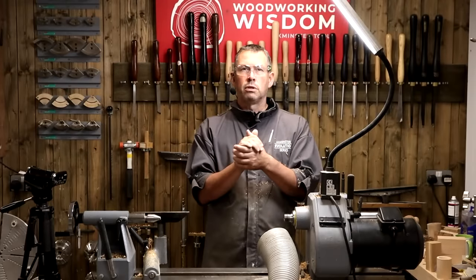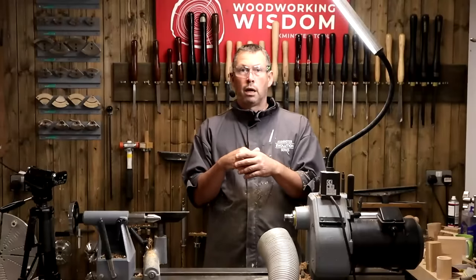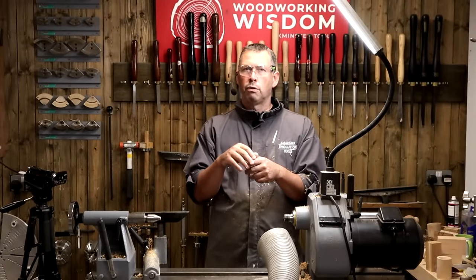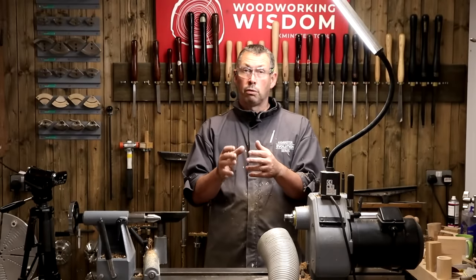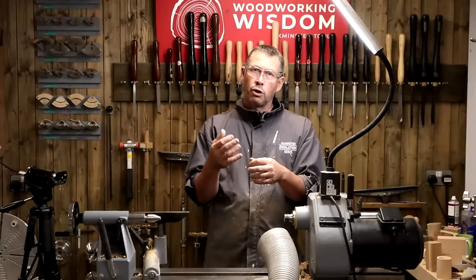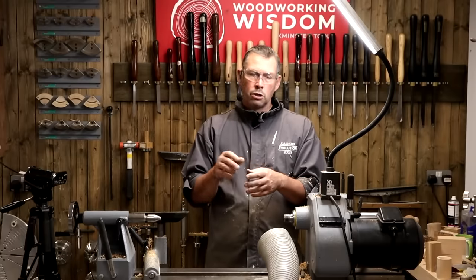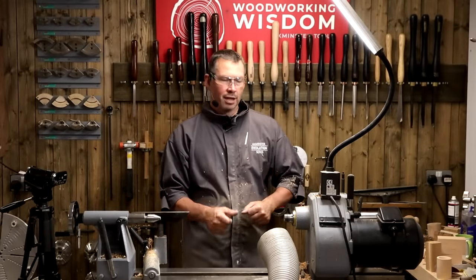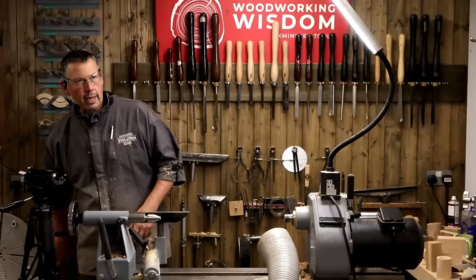If I want a high gloss waxed finish, I go for a high gloss wax, one of the Hampshire Sheens, for instance. If I just want a standard wax finish, I go for a neutral or clear regular paste wax. If I want a really high gloss, relatively hard finish, then I'd go for a spray on lacquer, because you get no brush marks at all, no polishing lines. If I want a softer, shiny surface, I'd buff, so things like Triple E or buff compound and then carnauba wax over the top. So there's so many different types depending on what the project is. They all require something slightly different. Unfortunately for us, there is just no one stop for a finish. It depends on what you're making.